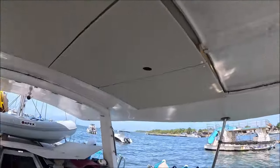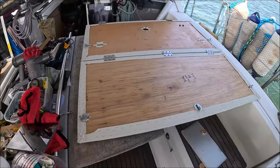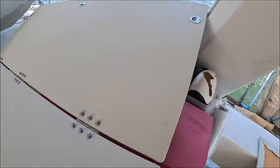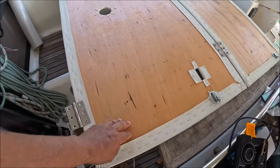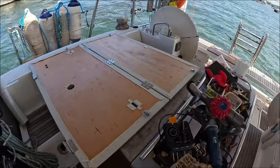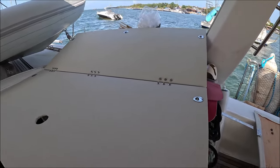Preliminary status — it certainly took some time, but significantly more. We have the front panels temporarily here, and we have what we use to measure the level. Alright, this is the inside — the locks are already installed. This is already ready for installation. Because the plywood is 9mm thick, the screws hardly hold and get pulled out, especially under such a heavy load. That's why we decided to fasten everything with bolts. They will be sticking out on the outside — it's noticeable — but we made them with nice looking nuts. I think we can live with this compromise.